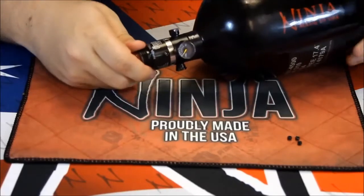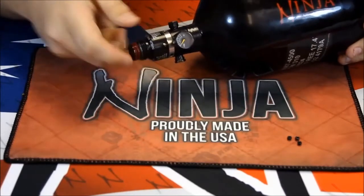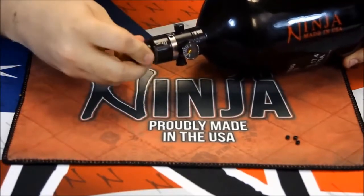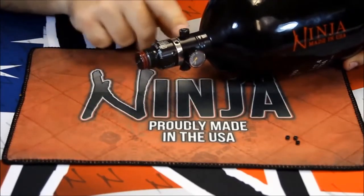Alright guys, so got those bonnet set screws removed from here. They're right there. Just 3 of them, remember, on the top portion of the bonnet there. If you did remove all residual pressure here, you won't have any difficulty unscrewing this. So if you have any difficulty here, make sure that you press down on this ball, make sure that any residual pressure here is released.